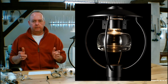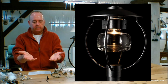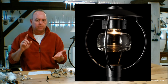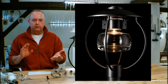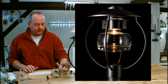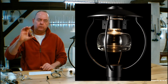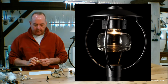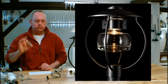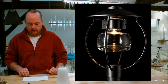In the middle of that is called warm white. Warm white is 3,000 Kelvin. That's the light that's coming down on me right now from the bulbs above. These are all LEDs. People think these are incandescent because they're so good, but they're actually LEDs. It's a nice warm glow. So if I were you, I'd probably go with a 3,000 Kelvin 60 watt equivalent bulb, and you can find it at any hardware store. You might be able to find these at your local drugstore. Even your grocery store should probably have these by now, but you can definitely find them at any home center. Let's talk about something else.